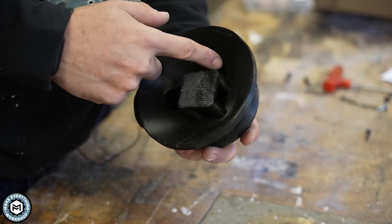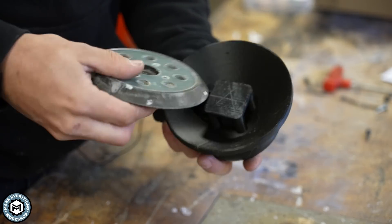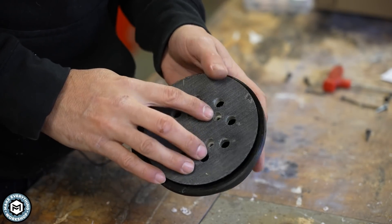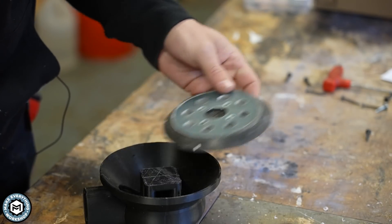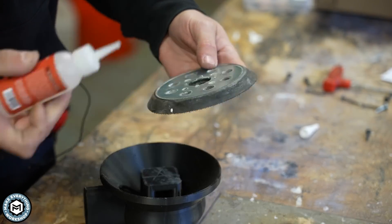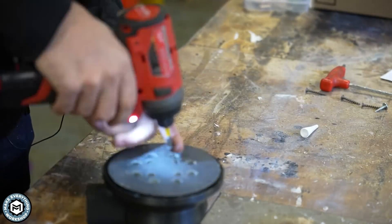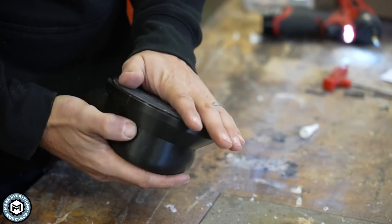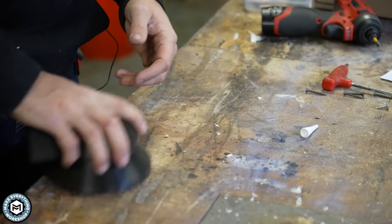A way around that would be to make the infill 100% — since the walls are thin it's probably not going to take much longer — and then you'd have a really solid place to drill in some screws, which would make this last that much longer. But for now, I'm just going to throw some one-inch screws right through the holes and into my 3D print. Maybe for some extra grab I'll put a couple of dabs of super glue that I could break off if I really had to. That's it for the five inch pad — literally just four drywall screws, then I can put a sanding pad on there and this thing is good to go.